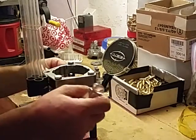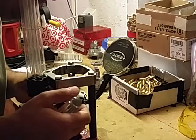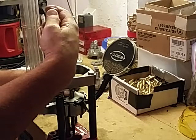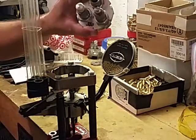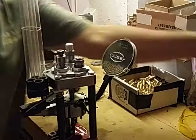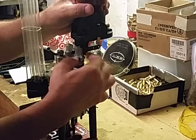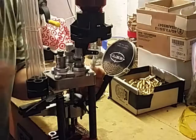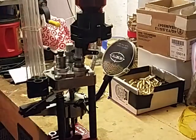I'm going to put my — for better terms I'll call it the bullet dump pin — right in. Kind of awkward getting in there, there's a little alignment slot. Screw that back down. Take your 380 die and turret, put that in place, screw this back down. That's the spring — you might have a chain. I just had this spring wrapped underneath here, worked out really well. I broke the chain like the first two hundred rounds I did.